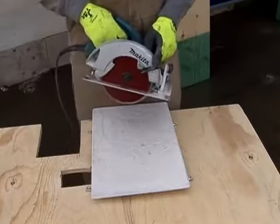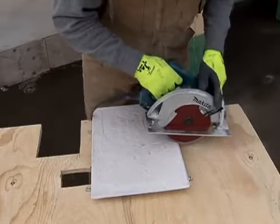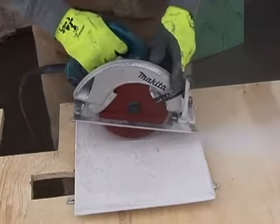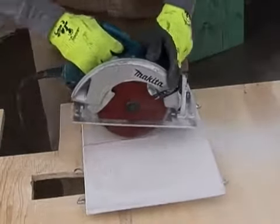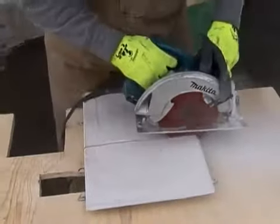Make your saw cuts from the front of the tile. Cutting through the back will often cause chipping. You should always pull the saw backwards as you start with a scoring mark. Otherwise, your pencil line will get covered in dust to the point that you can't see it anymore. Make sure that you cut right through the tile on both ends first.